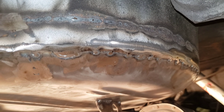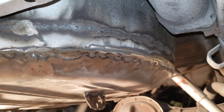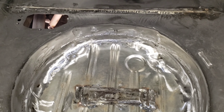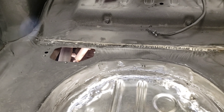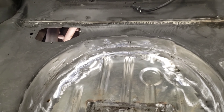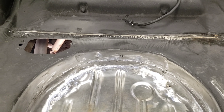I'm too tired to do any more out here tonight — about four hours tonight. Tomorrow I'll come out here and finish grinding the bottom. After I've got the bottom finished grinding, that's when I'll get the fiberglass-reinforced body filler up here, get that on, and I'm just going to do a quick sanding around it with my DA. Get it smoothed up pretty good because the inside of that opening is far from perfect, but it'll look good when it's painted — it won't look any different than what factory was.